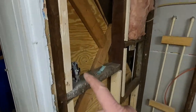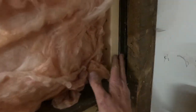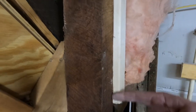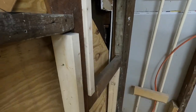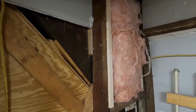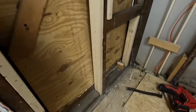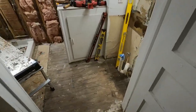So what we're doing now is truing these walls back up. These are true, and these are true over here, but this one's not true - can you see the difference of it sticking out right there? So I've had to true those up, and that's why I'm rebracing them. The wood may have been bowed when they put it up, or may have moved over time - you can see a little gap right there, may have slid back a little bit.